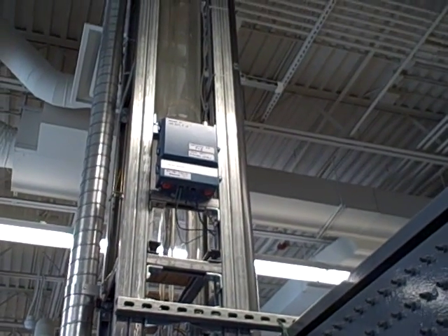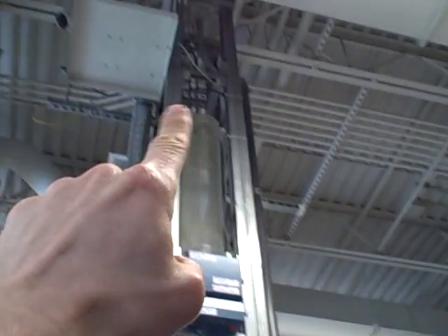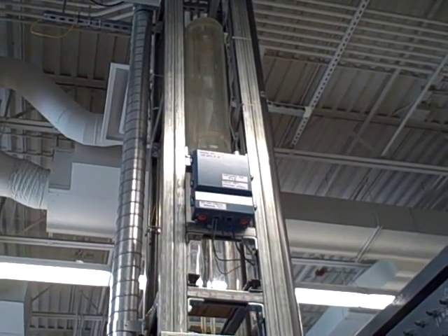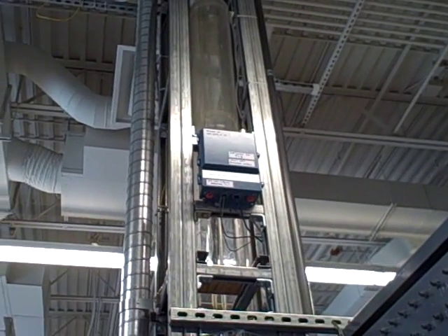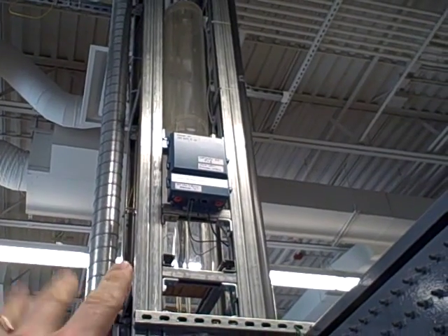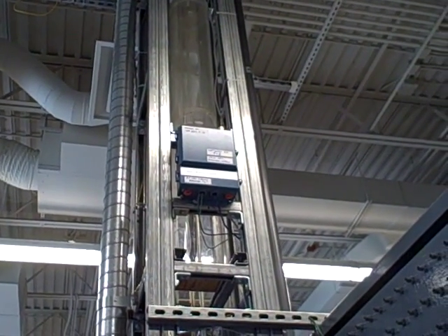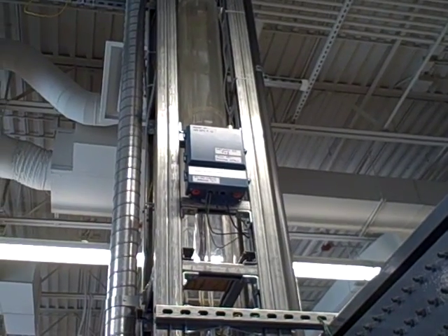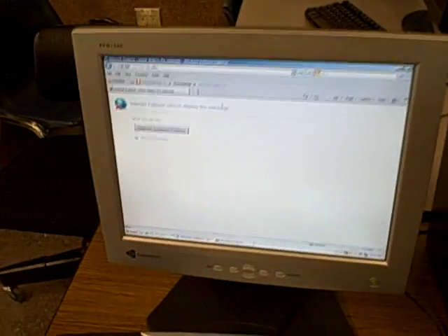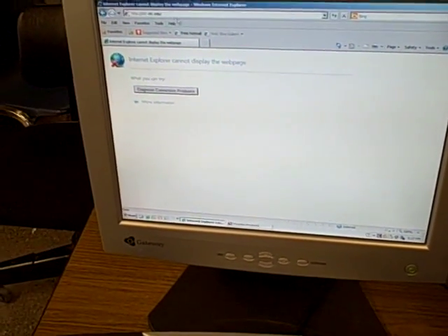The gateway device has a black cable running up to the ceiling through a whip antenna on the roof, and that's how it's talking to the devices sitting out on the campus lawn. To configure, monitor, and diagnose things with the data points within the gateway network, they made it very easy and convenient — they equipped the Smart Wireless Gateway with a web browser. Any computer on the same Ethernet network as the wireless gateway is able to communicate to it using any standard web browser like Internet Explorer.